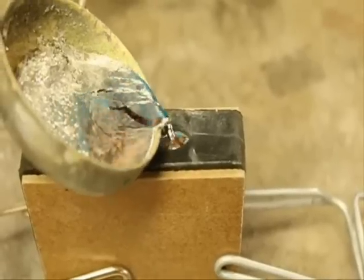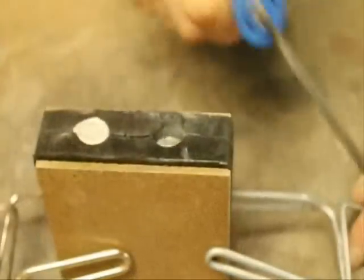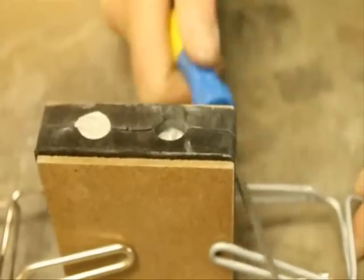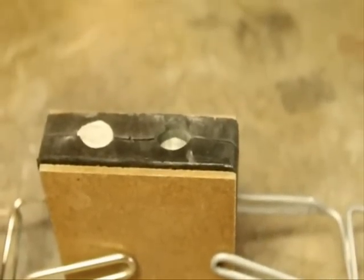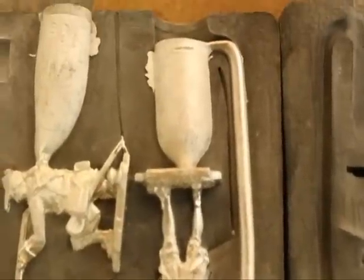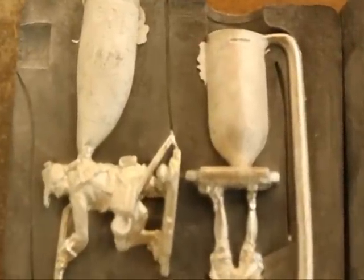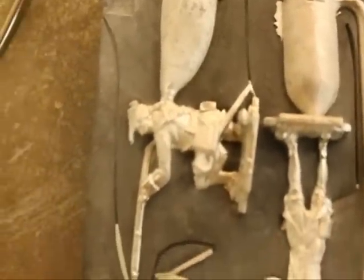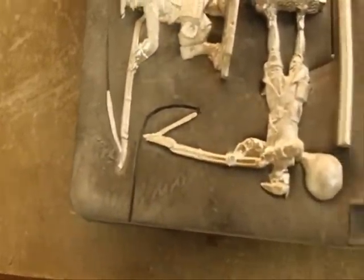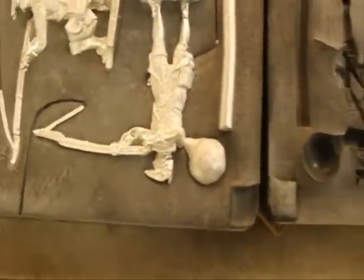After pouring metal into the mold, tap it for 5 seconds to help shake the metal into all details. It helps get air out too. Finally, check the casting to see if all the details and vents worked as you intended. If so, then you can cast with it hundreds of times without further alteration. Time well spent.